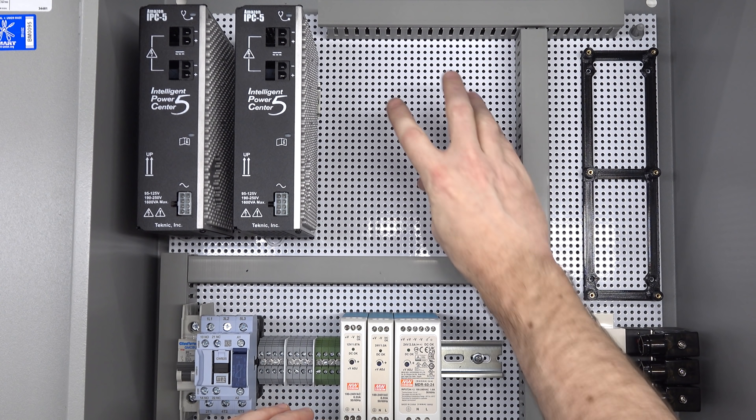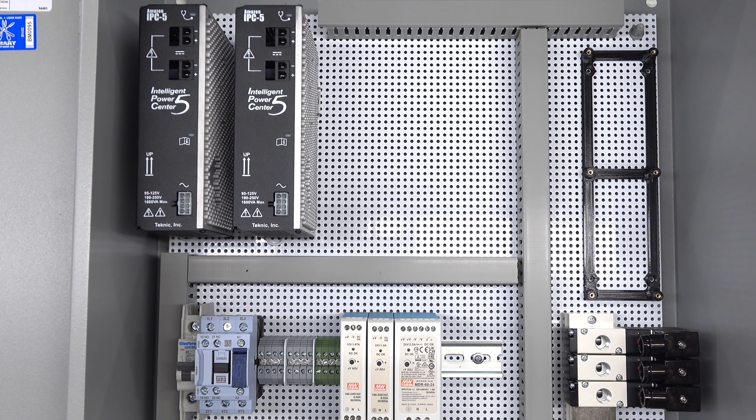If you've never worked with this stuff before, this is a back panel that the box itself — you can anchor things in the box if you wanted. But you can also buy these panels that sit in the box, and these panels allow you to mount everything to it. In fact, you can take it out of the box to work on it. This is one that I actually made because the perforated panel was backordered — I just used my plasma cutter and painted it. But eventually the perforated back panel came in, and if you've never worked with one, they are amazing. These holes are the correct size for a self-tapping number eight screw, and I think they're actually the right size if you wanted to run an M4 tap through them. They're on quarter-inch center, so it's really easy to run down things like wire duct just using screws.